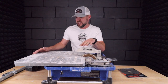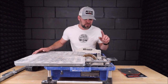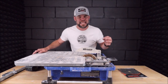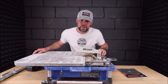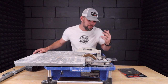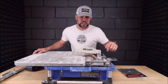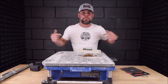We have cut notch cuts out of two-foot by four-foot tiles using this with the fence removed. One of the only cons I really have is that the sliding tray system — the mechanisms used on these bars tend to get gummed up every remodel we do. So you have to grease them up. We simply clean the saw, spray some WD-40, wipe it down, and you're good to go. If anybody knows of any better grease to use, I'll leave that in the comment section below.